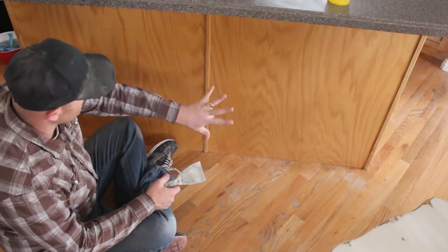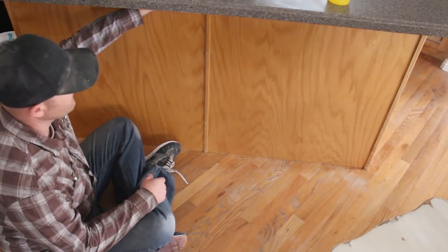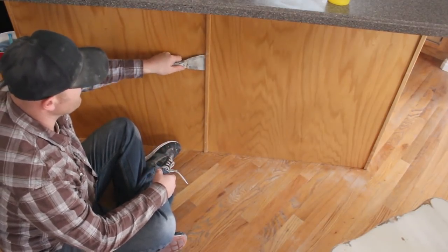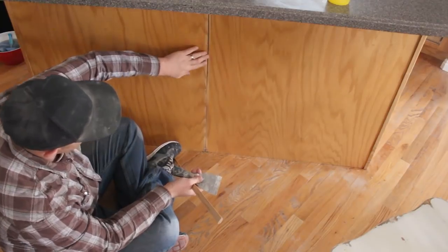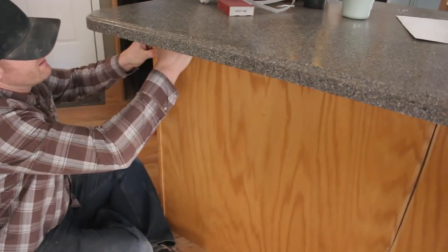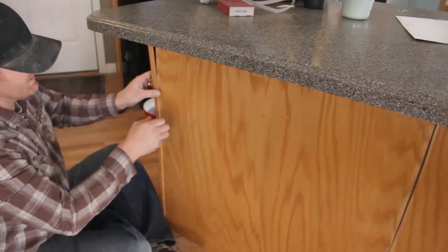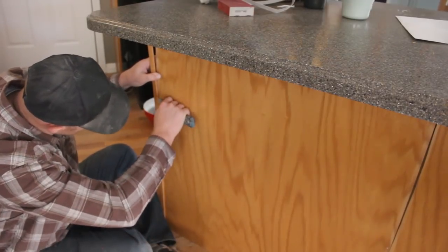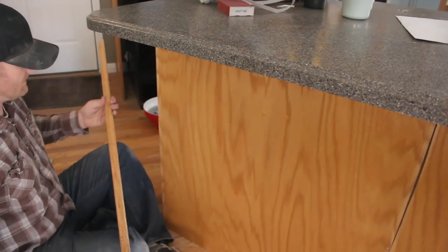This is the back side of the island and we're going to be trimming this out and adding corbels. I'm removing this trim with a spatula — it's pretty stiff, not very flexible. There are just a couple little nails and some glue hiding the seam between the two cabinet sections. There's also some trim on the edges that's going to go. I'll pop that off the same way — it's a little more difficult because it's at an angle with nails on both sides.